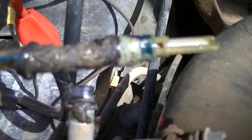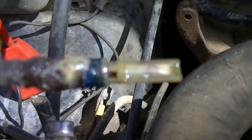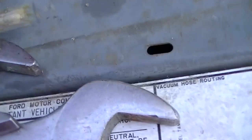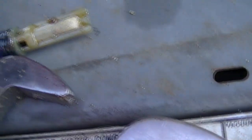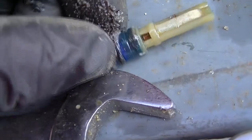Let's go ahead and hit the other compressor. That is what they call black death. You're supposed to replace the whole system. It's just full of crud — that is from the compressor, actually.